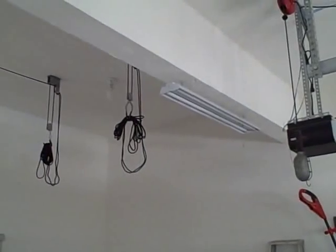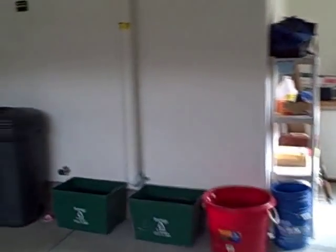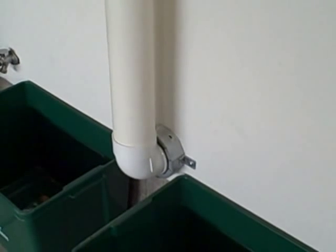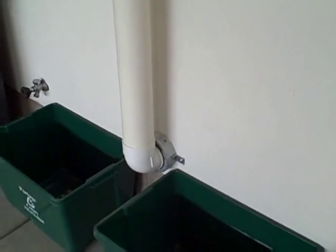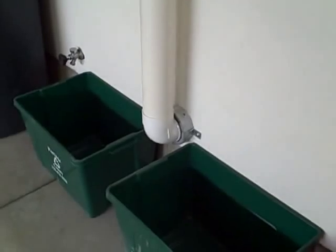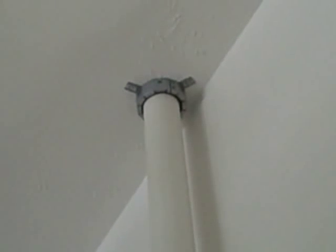We had to route towards the right side of the home, and in the next video you'll see we discharged out the side of the garage roof. The system has labels at each level of the home. The silver devices you see right here are fire collars. Anytime we penetrate the firewall separation between the garage and the interior of the home, we have to put a fire collar there. The material around the collar simply expands should there ever be a fire in the basement, garage, or attic space. There's one at the ceiling there because there's living space above as well.